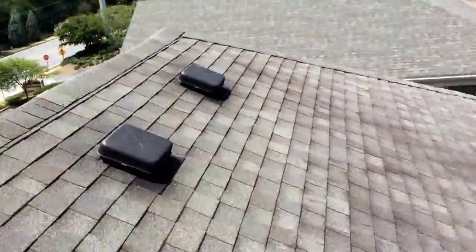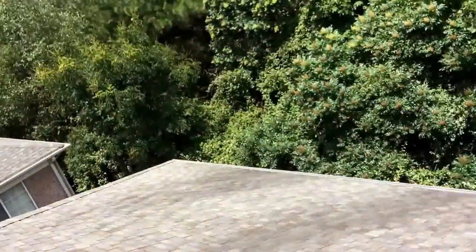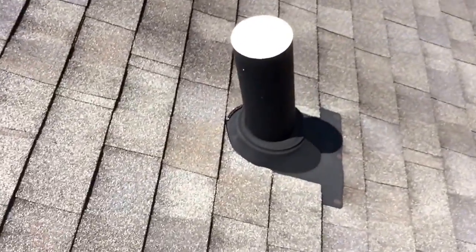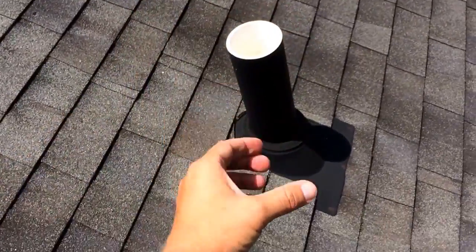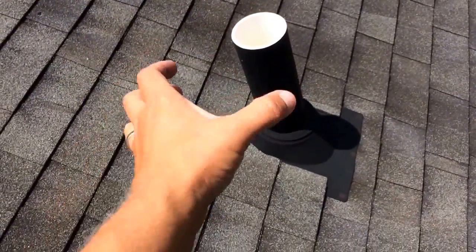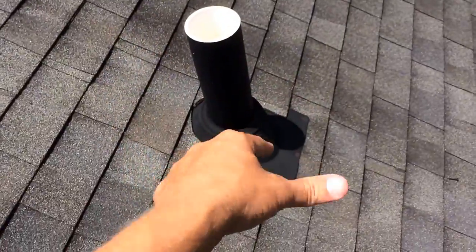That's the case on all the turtlebacks, and that's the same case on all the buildings. While we're up here, I would want to go ahead and add rain collars to the tops of these pipe jack boots. They're not split and leaking yet, but a rain collar will be a rubber gasket that goes down over the top of that. It'll take the brunt of the UV rays and will start to dry, rot, and crack, as opposed to the functional boot that's holding the water out.